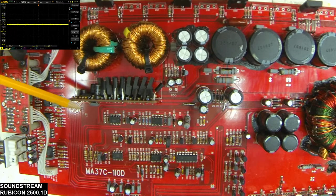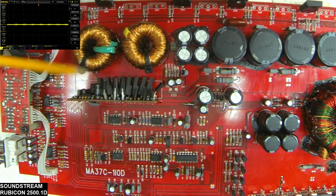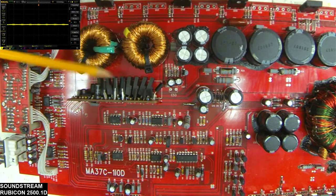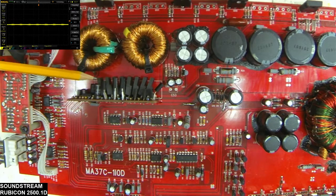That's pretty much the layout of the output of these boards. I would always double check that if you have drive without the transistors but then you install the output transistors and start having shorts, check your output inductors — they're notorious for shorting on these. Again, these run hot. If you can get a fan mounted somewhere in here to get some air moving across it, it may help the longevity of your drive on these 2500s.